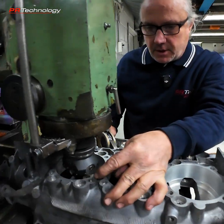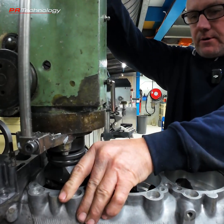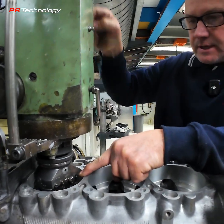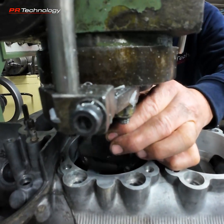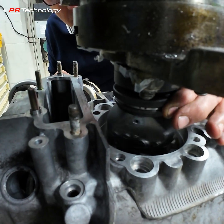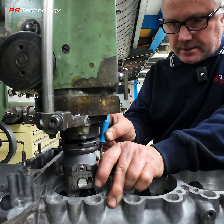This is a boring and facing head. It might look like I'm getting personal in here, but that's how it works — there's a dovetail in here, and one part of the head moves away from the other when you hold this collar. That means this part actually moves inside the bore to cut our groove, which is quite tricky. I'm going to set up the depth stop so we know how deep the groove is going to go.